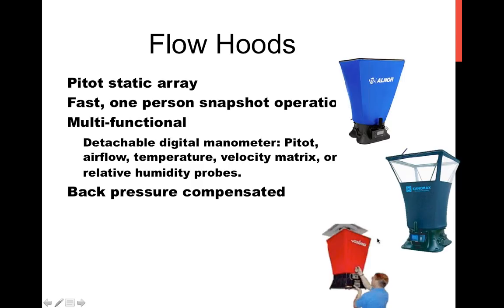And how big an issue is it really? Again, sorry, it depends on the kind of measurement you're trying to take. You're welcome, Greg. It depends upon the kind of measurement you wish to take and what you're going to do with that information. If you can only make an adjustment in system airflow in 250 CFM increments, do you need to measure down to 5 CFM to make that judgment call as to which way it goes? Perhaps not. So keep in mind where you're using the information.